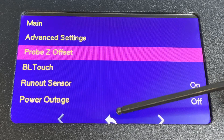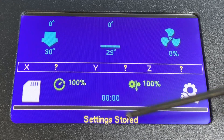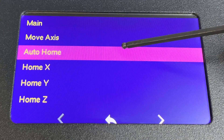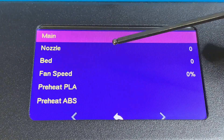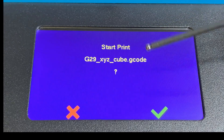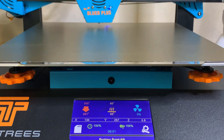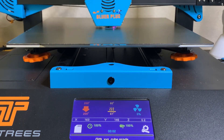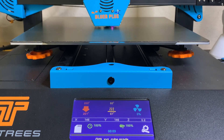I will check the Z offset and make sure that it's still the same value. I will store the settings one more time and do auto-home to make sure all the stepper motors, limit switches, and homing direction are all correct. I will also preheat the printer and make sure the nozzle and print bed are both working normally. Let's print a gcode file with the G29 command — the printer is doing auto bed leveling and the print is starting with the info screen displayed correctly. After flashing the Marlin firmware, the only issue with the Bluer Plus has been fixed and the printer now works flawlessly.